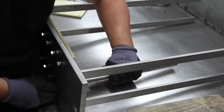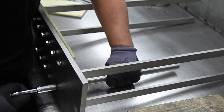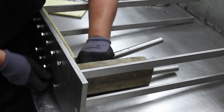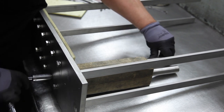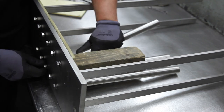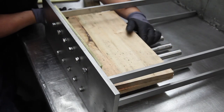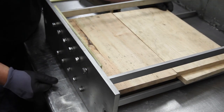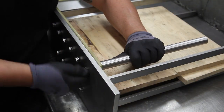To add tubes back to the automatic carriage face, start with the bottom row and bolt the first outermost tube in place. Cover the secured first tube with the guard block again, then bolt in the second tube. Move the tube guard to the second tube and repeat the process until all the bottom tubes are in place. Before bolting in the top row, place wood boards on top of the first tubes, covering all magnetic sections. This will help ensure your work is safer around the magnets. Repeat the process for the top row using the tube guard provided.